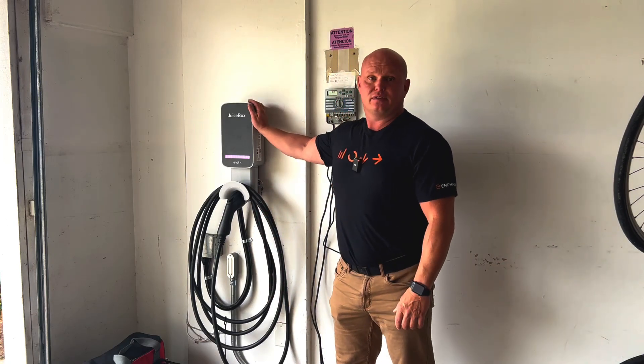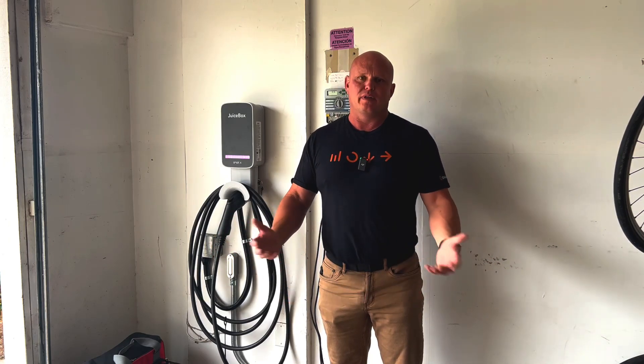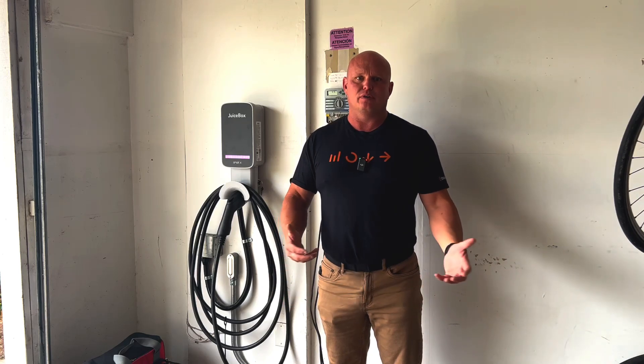Now that we're releasing the Enphase IQEV charger, we're on site and we're going to upgrade the charger that was existing — the JuiceBox — to the Enphase charger. This is going to benefit the homeowner in the sense that when the solar is producing and the loads are not using all the power and the battery's full, the EV will be able to take all that extra power and charge the car, so they're actually able to keep more of that power on site versus exporting it to the utility company, where they now, with any NEM 3.0, have a lower feed-in rate — and it's just a better ROI and a better investment for the customer.